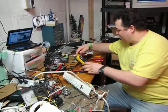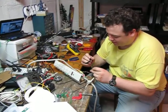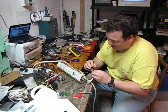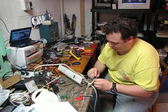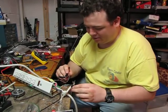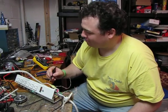But I'm going to proceed with tickling the inputs and seeing if the other channels light up. There we go, there's one. Channel one — channel two is shorted on, it's failed on, I'm going to figure that out. Channel three, channel four, channel five, and channel six. Five out of six are working. Awesome.